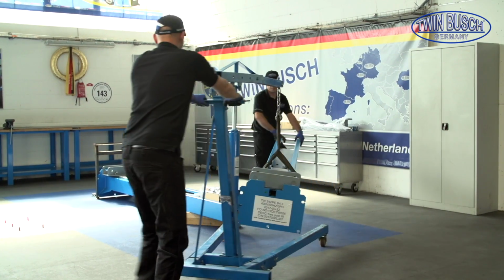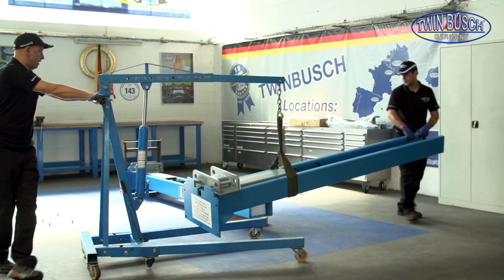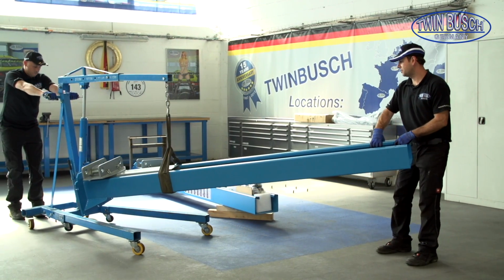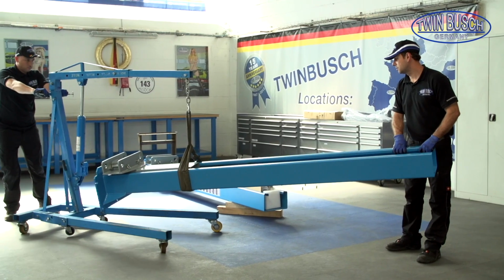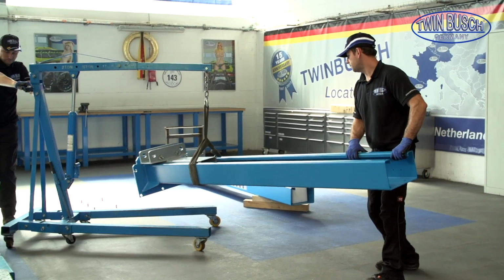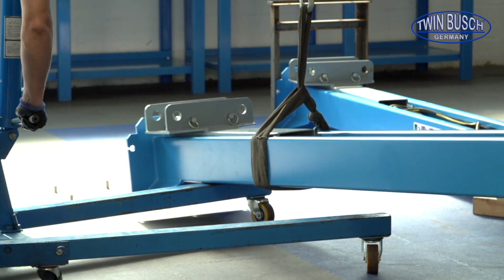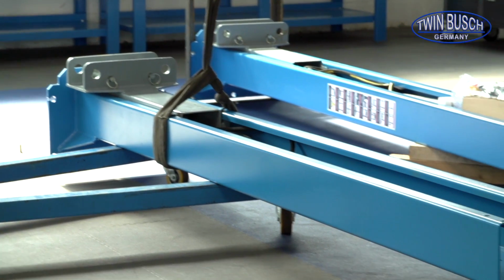The upper post is also the main post where you later fix the motor unit electric cables. Depending on which side you will be driving onto the lift, place the main post to the left, which is normally the driver's side. When in position, we let down the post.